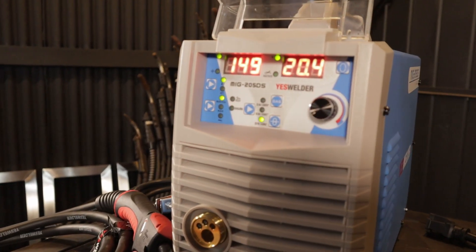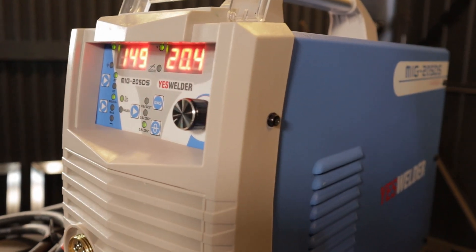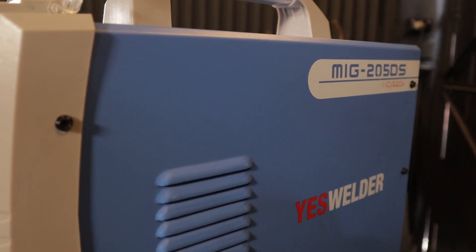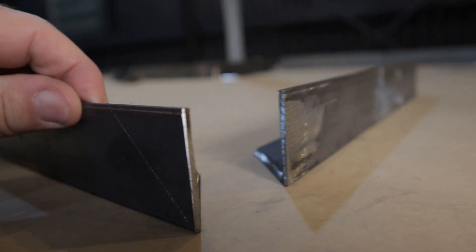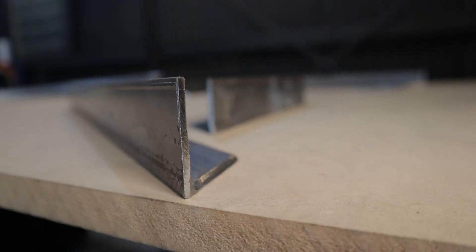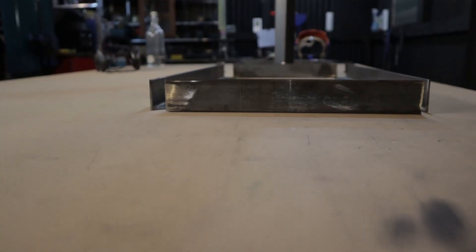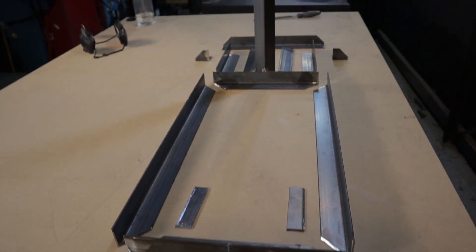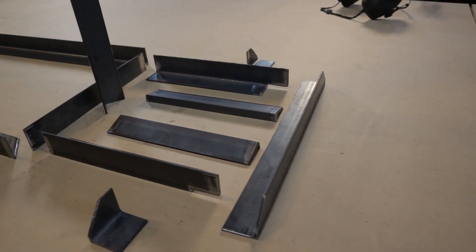Because it's the welder's right of passage to weld their own welding trolley, I will be using MIG. I don't want a high weld profile, so I'll prep the angle. The order you weld things has a big effect on whether the product remains square and how easy it is to weld — I'll go down that rabbit hole in the next episode. I'll weld the inside of the angles first, giving a prep on that side. This is called a V-prep or groove weld — the prep is usually a 60-degree V, or 30 degrees on each side. The remaining flat part is called a root face, but in this situation I'll have a knife edge.